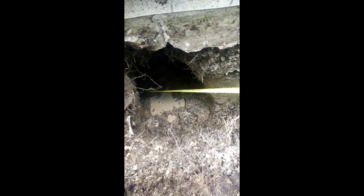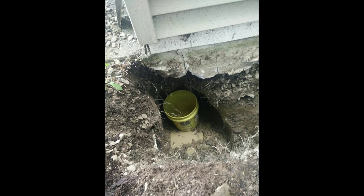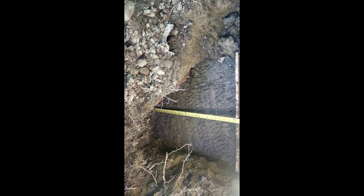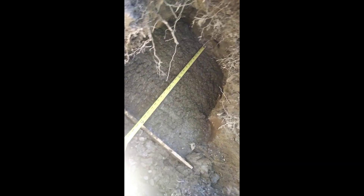So 24 by 24, and I'll pour it 12 inches thick. Out of the 24 inches, I'll put a board in so I don't have to pour quite as much concrete. There's a bucket for scale. It also has to be 42 inches deep — 42 inches to where the ground line is — so that's good for depth too. It's a full 24 inches across, and trust me, it's 24 inches the other way too.